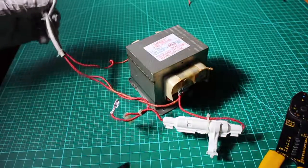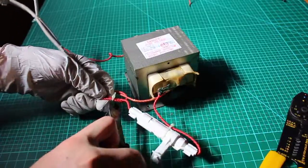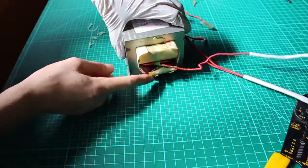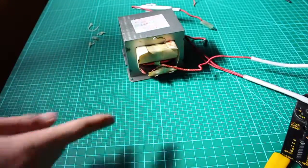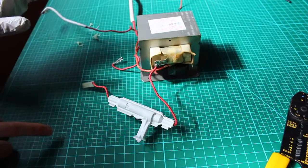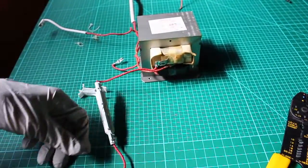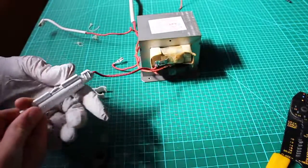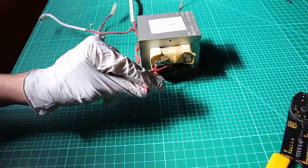There were a lot of zip ties on the cables that came off the microwave transformer. If you have any zip ties, just clip all of them until there are none left. How this works: these two leads here hook up directly to the wall power. The coil that transforms the electricity into high voltage — one lead of that coil is connected to the casing, so the casing is grounded, and the other wire comes off right here. My transformer came with a fuse attached, and we don't really need a fuse, so you can either harvest the fuse or just cut the wire — that's what we're going to hook up to our Jacob's Ladder.